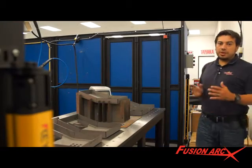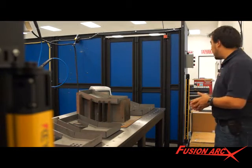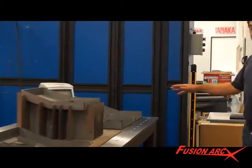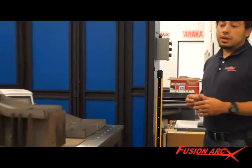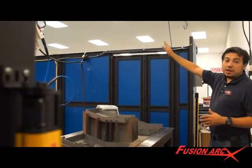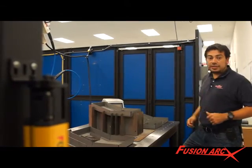When your application grows beyond 56 inches wide, there are a couple different door options we can provide. One of them is the light curtain barrier safety. It provides an e-stop for the robot whenever you break the light curtain. It's muted so you can actually load and unload one side while it's welding on the other. It provides no obstruction up top so you can load and unload big parts with a gantry crane, and no obstruction to walk in and out of the cell on the bottom.